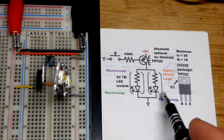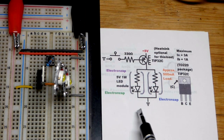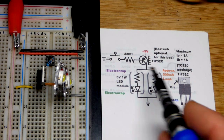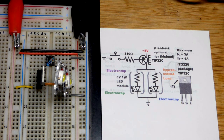This isn't an exciting circuit — it's a simple switch circuit. But if you're switching higher-power loads than what a TO-92 package can handle, which is closer to half a watt maximum, this transistor is useful. You don't even want to push the TO-92 to its limit. Just be aware of that. That's really about it — thanks for watching, make sure you check out the other videos, and I'll see you in the next one.